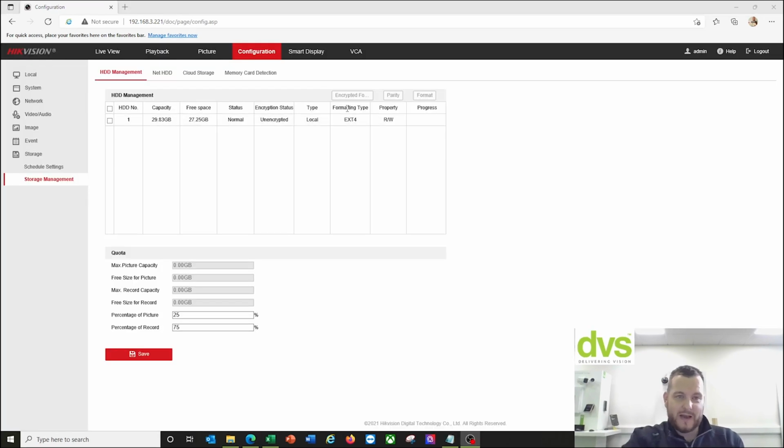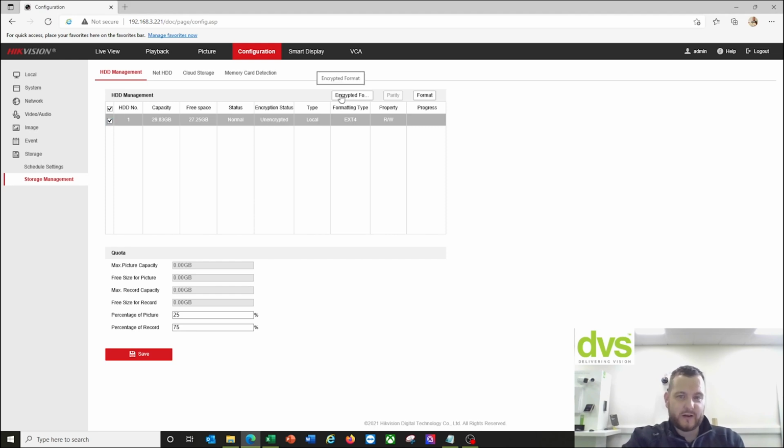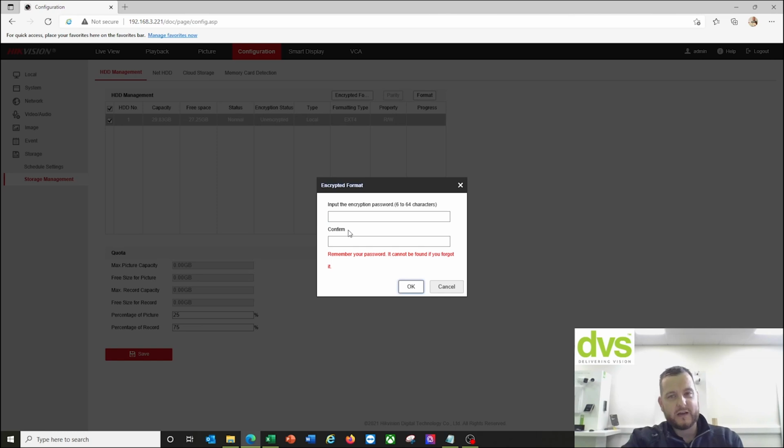Okay, you're back with me. It has now formatted. I put simply a 32GB SD card in there. And I can, if I want to, click on that and encrypt it. If I encrypt this, I need to put an encryption key in there. You need the encryption key. If you remove the SD card and need to play it back, for instance, you will need to then insert the encryption key to be able to get any data off there.